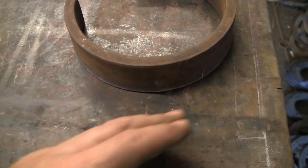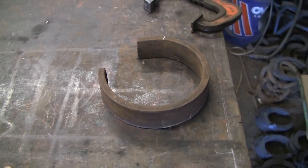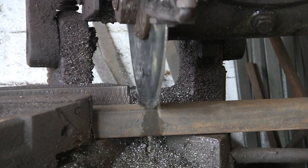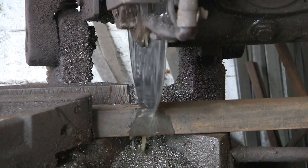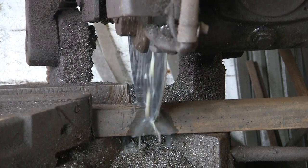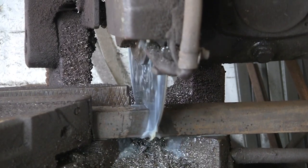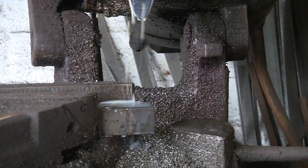First thing I'm going to do is probably weld this on here far enough up so that I don't get 90 degrees — I want just under 90 because it's got an angle on the hood on this canopy. So I want to weld that far enough up the bench so I'm not hanging off. Let's cut off this bit of heavy old bar. This might take a little while because the saw blade's a bit blunt — one of those jobs you never get around to. Every time you use it and feel it's blunt you think you must change it, then get on to another job and forget. I don't often cut anything this heavy anyway, so it's usually light stuff I'm using on here. It's lubricated by cutting oil.